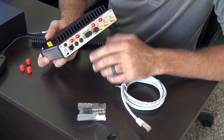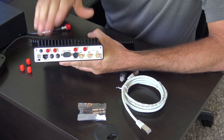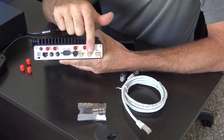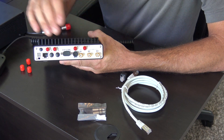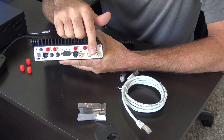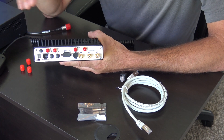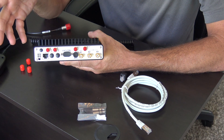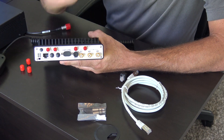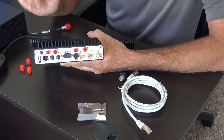The connections on the back allow you to hook up three different antennas at one time. A1 is primarily for VHF only — two meters. A2 and A3 are both for HF. You could have a tri-band antenna on A2 and a mono-band on A3, or a receive loop on A2 and a vertical on A3. As you switch through the software, you can set 20 meters on your three-element beam for transmit and a sky loop for receive, but 40 meters just on A2 for a mono-band vertical. You can set that all up band-specific in the software. Very powerful.